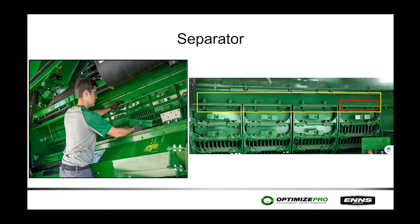For separator grate covers, start with minimal or none and add as required to maintain even shoe loading. Never place separator grate covers in front of your grain loss sensors — that would block the sensors and falsely indicate no losses. When changing from small grains to corn, remove the bolts, drop the grate, and place the spacers between the grate and frame to prevent cobs from getting smashed and ending up in the grain tank. The rear grate on 80s and 90s has no spacers because there is no clearance with the tailings auger return tube.